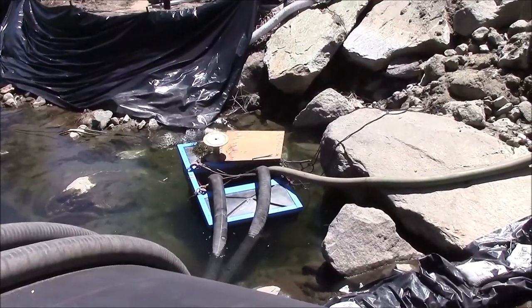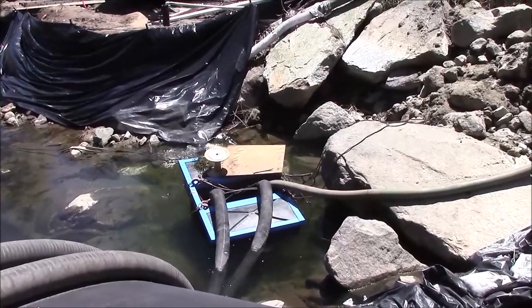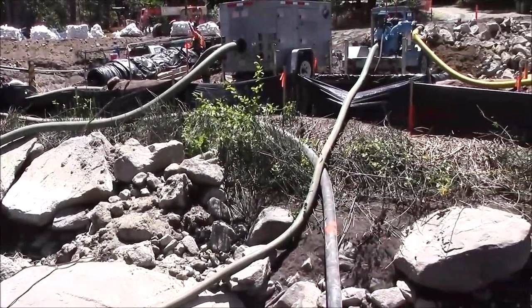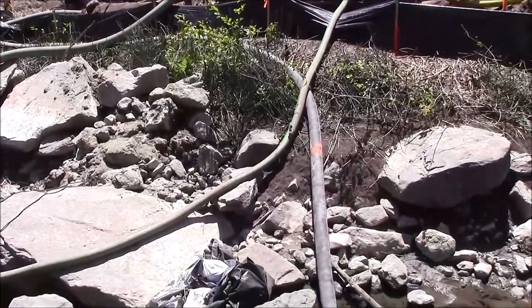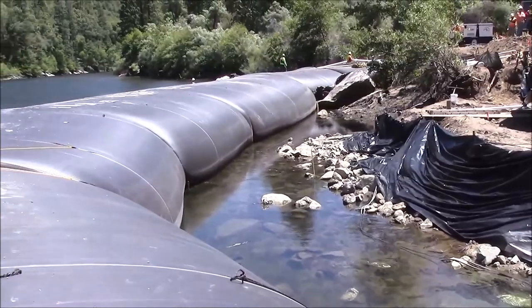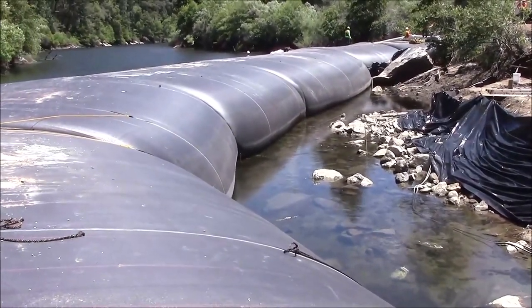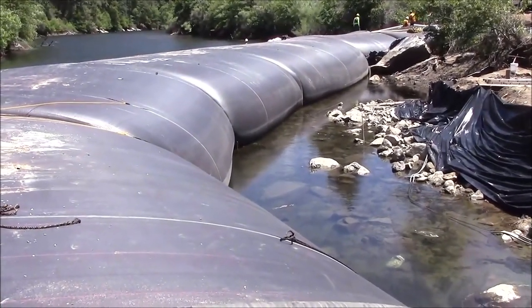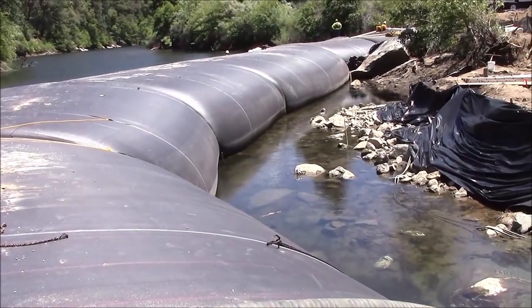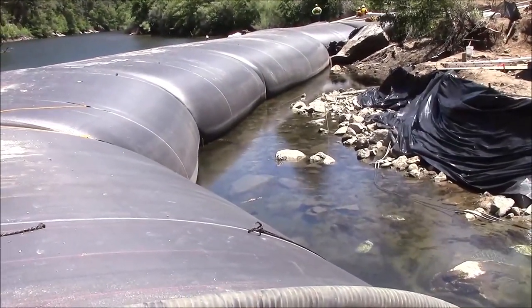One 10-inch pump, two 6-inch pumps, and one 4-inch pump are being deployed to keep the work area dewatered, keeping up with the seepage along the entire length of the AquaDam over the rocks and generally poor condition of the sediment. So